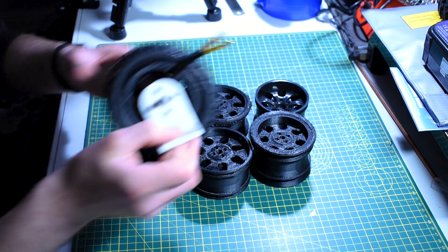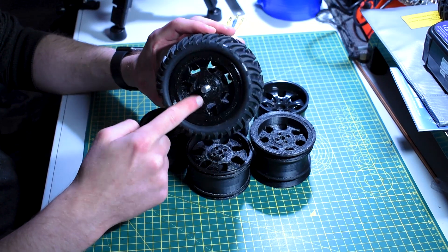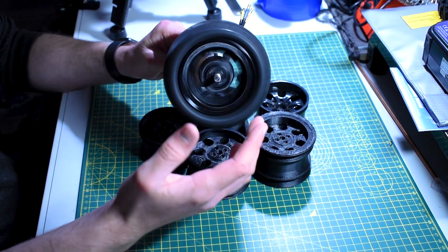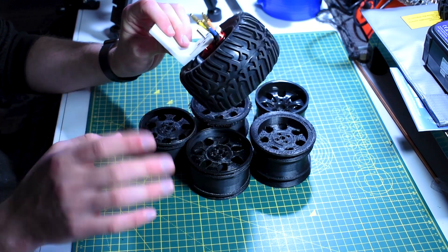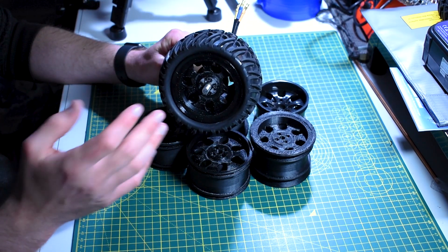So what I've decided to do is move towards something where we're coupling directly to the wheel. That way you've got instant torque, instant power — everything's there. It's the most efficient it can possibly be. There are no losses between any of the axles or the joints, and I think this is going to be the best way to limit vibration and remove any of those unwanted issues.